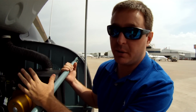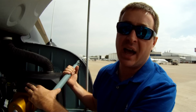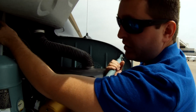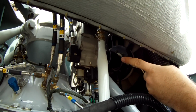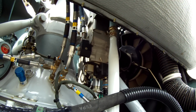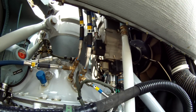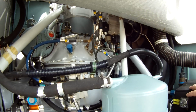To date in the EC-130, I will stand to be corrected on this, there's never been a known hydraulic failure. It's got dual redundant hydraulic servos, when really it looks like one big servo, but the servo's big enough that it's actually two separate servos all combined in one. There's 3 total servos, or really 6 servos for this EC130.